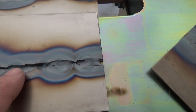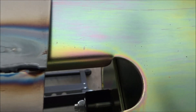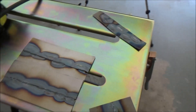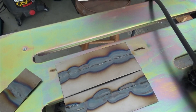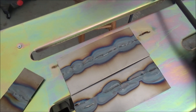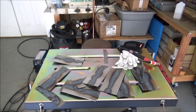Not too bad there - I think it's fused together nicely but it's really hot and of course I'm not very straight. Then it just kind of looks bad. I'm just going to keep messing around with this and see how long it takes me to get it right. I'm easing into the pedal and going about half power. I've got it set for about 90 amps but it's still too hot - I guess I'm going too slow, but I'll play around with it and see what I come up with.